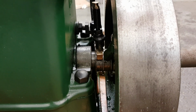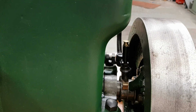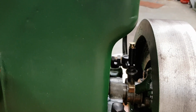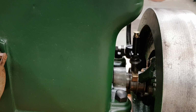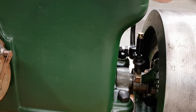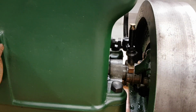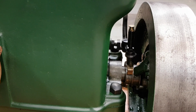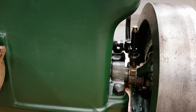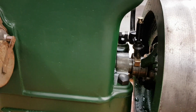on the crank. The crank actually has a flinger ring, so any oil that seeps along the crank and gets into that void there actually gets flung off, and then there's a little hole where there's a drain. So you've got to make sure you get those bearings in the right way, because otherwise you won't get oil in from the top, and then any oil that you do put in won't seep back into the sump. Actually thinking about it, I don't think they fit either way anyway, but it's an interesting thing nonetheless.